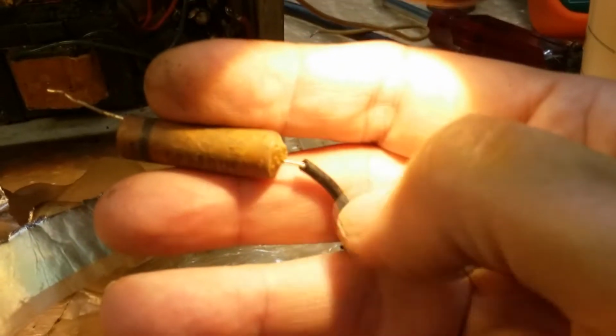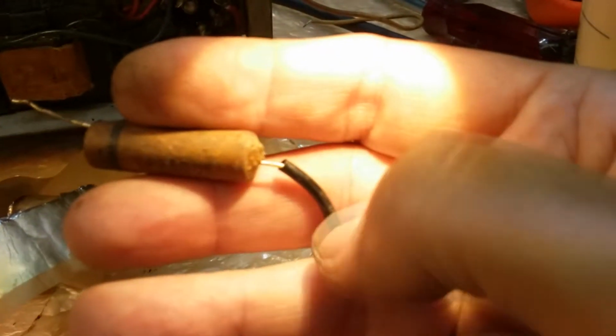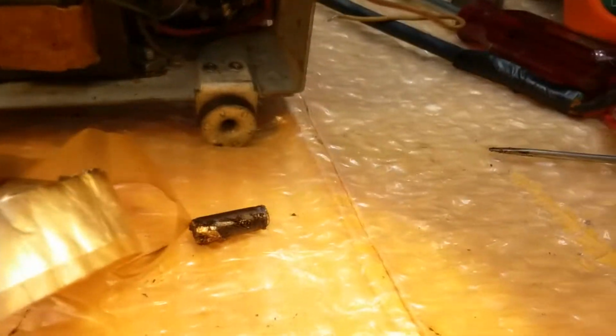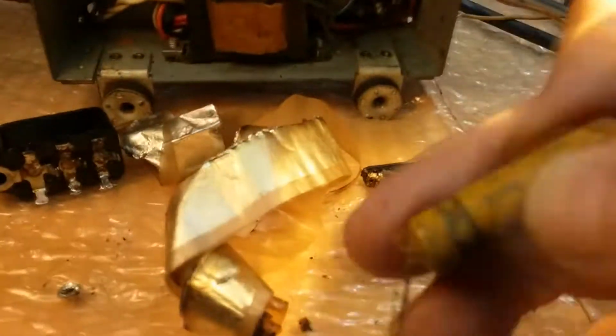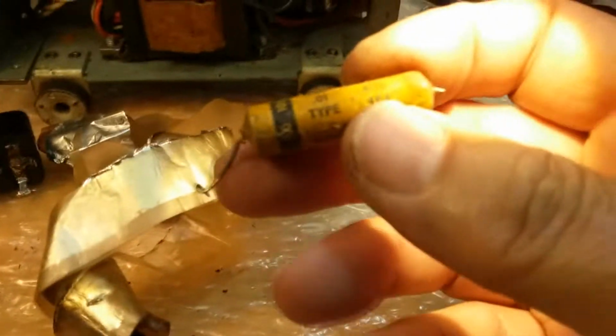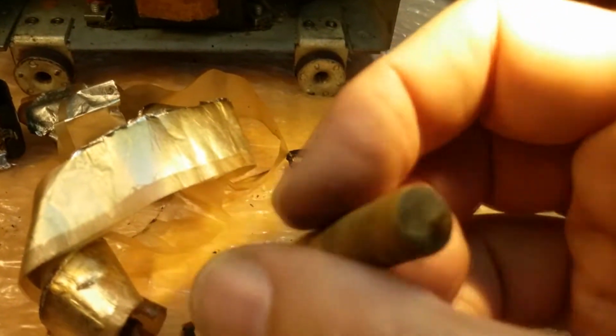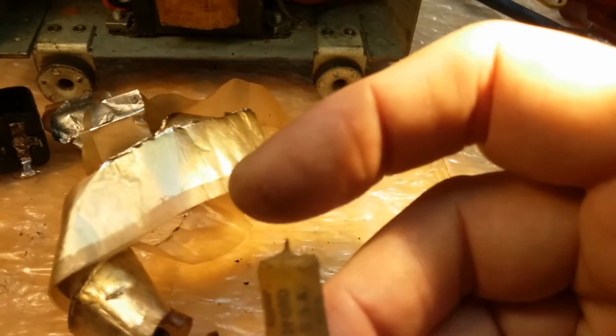And so the part that connects to the amplifier part of the circuit, whether it's IF or audio, doesn't have much surface area. It's just a little fine wire. The other thing is when you put these in, and most of these in the right circuit are that way, you'll notice that they have much longer. Now I cut this one out, but you get the idea. It's much longer on the ground side because you want to pick up all the noise around it and send it to ground, including from the foil. And on the positive end, you want to keep that as short as possible.